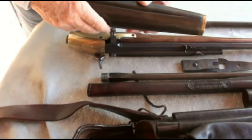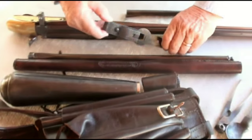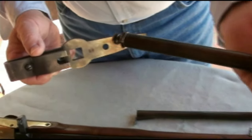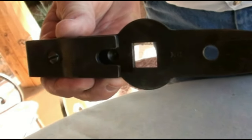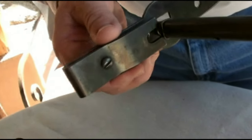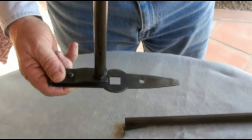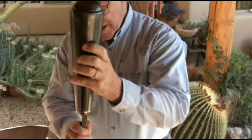Let's look at how the Austrians pump these up. Let's go back to the pump — this also is ingenious. The U-shaped slot accepts this rounded piece, and if you can see down in there, there's a little impression, a well. The tip of this is going to go into that. The reason is so it's free to swivel — if this were a rigid system, we might break the pump. So we need an empty reservoir and we thread it on like so.